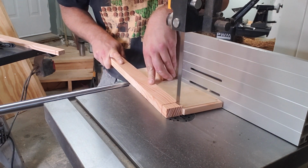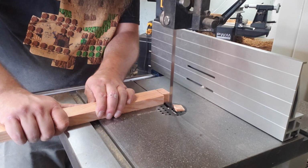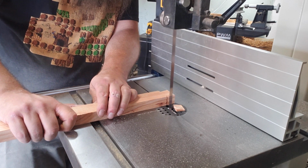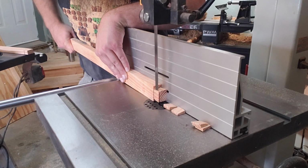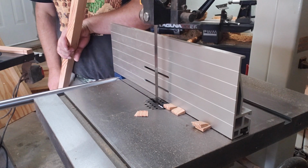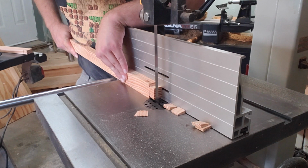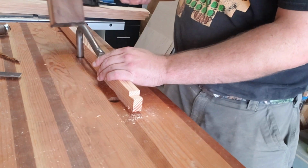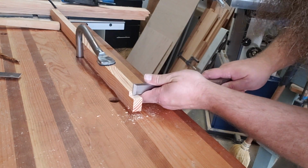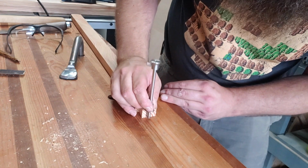I've done this before with a fence angle jig thing that I learned from Matt Cremona, and then cut those sides off and chisel to clean up all those faces. Did cut the bottom cheek, I guess it would be called, which later will end up helping me out in terms of laying out the pin board, which is the top of the leg, and you'll see that in a second. So once that gets cut on the bandsaw, you can clean that up with a chisel,